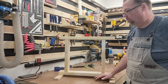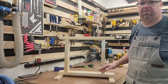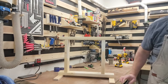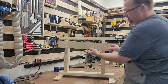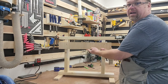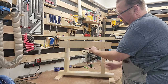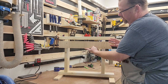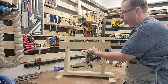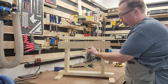I've built a mock wall here showing what you'd see in an average unfinished garage — a bottom plate, top plate, and a couple of studs 16 inches on center. People often take cleats and mount them directly to these studs without any backing. You can do this for certain things — like hanging a cabinet that would touch both studs — but there are problems with using individual tool holders this way, and I'm going to show you what some of those issues are.